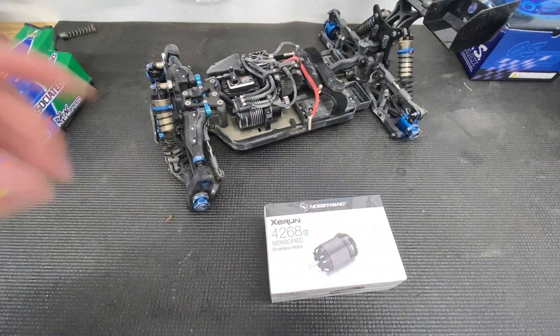Here is the Hobbywing. This is the Generation 3 motor, so you're going to have the fluted front. They both have fluted fronts, but you're going to have the tighter fins and the deeper flutes on the front. You have your different mounting options. They're captured, so even if you run a clamp-style mount, you're not going to get dirt in the motor. It's all sealed. Here's the rear end — it is adjustable for timing right there. Mechanical timing, and you can also do timing in your speed control, boost timing, all that good stuff. A, B, and C wires, of course, and then your sealed rubber seal on there for your sensor port. Typical Hobbywing high-quality components.